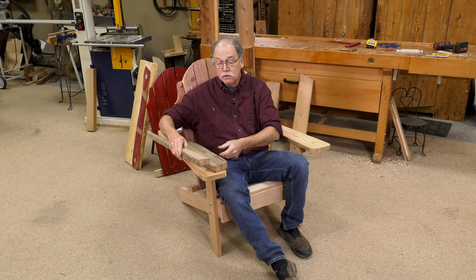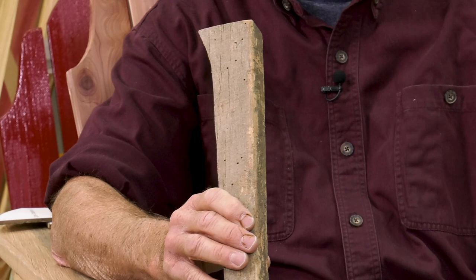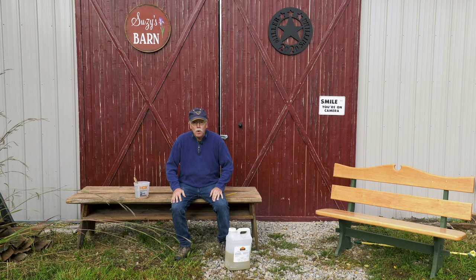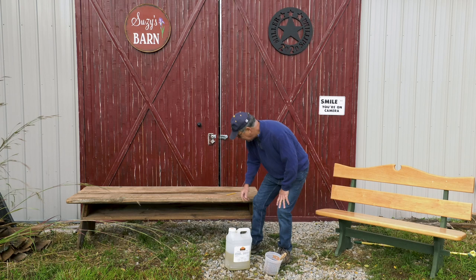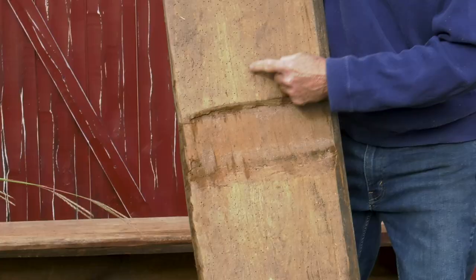Now I want you to look at this piece of wood. See those tiny little holes in it? That's recycled white oak — there's a story there. I recycle everything, and when it comes to wood there are some things you need to know. If you're going to take it into a heated space, the one thing you do not want are powder post beetles. This board is spectacular and ancient, but this infestation has absolutely gone crazy. Look at all those tiny little pinholes.